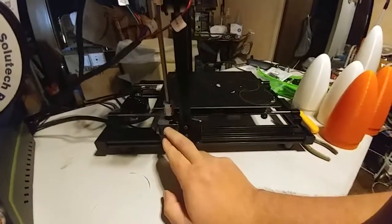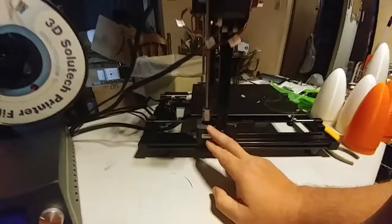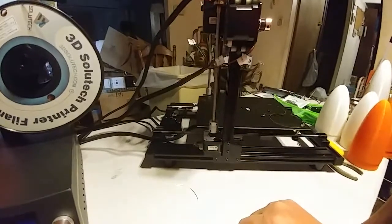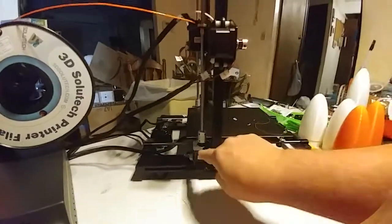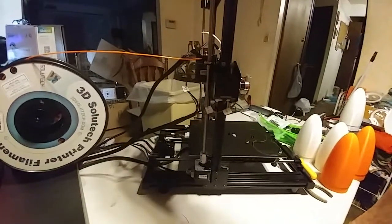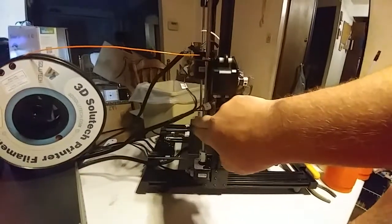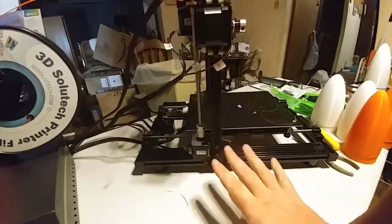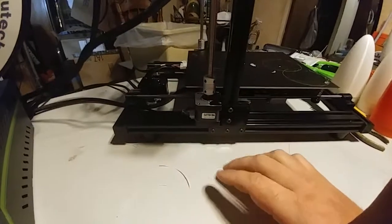I have to order new parts. I think my mistake was that the gantry was down low, so the bend force was a lot. I suspect I could have gotten away with it had I raised the gantry all the way to the top, which would give a lot of pivot room. But don't try it that way — just do it the right way. It only adds about five minutes to the process.